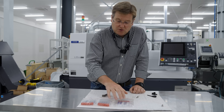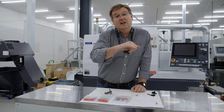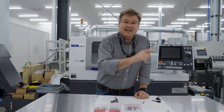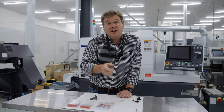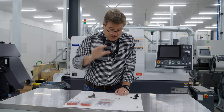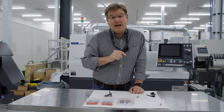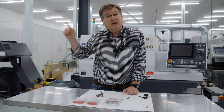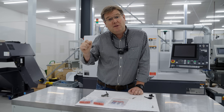So with these new tools now in stock, this first stop puts the initial chamfer on, this is the pilot drill, and then this is the final drill that puts the 0.17 millimetre hole down the centre for the primary nozzle — that's the nozzle we use for starting the engine and getting a nice uniform startup around the combustor. We're on with the production of these in two days time once we've got the machine set up again, and in the meantime Alex has been finishing off the commissioning and calibration of the spray nozzle test rig upstairs, so let's go up there and I'll show you what we can now do with that test rig.